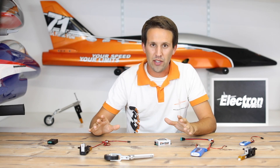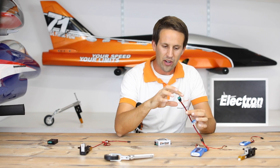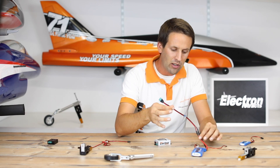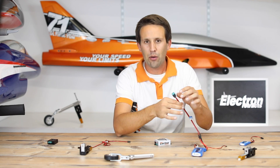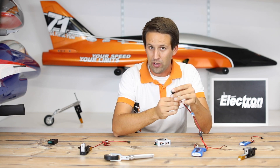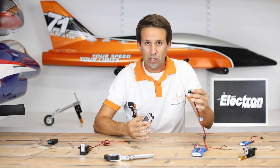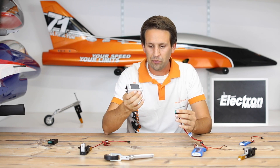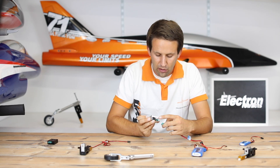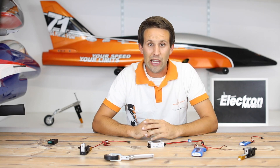Number two is even more obvious than number one, but it's still overly easy to make the mistake. Check the polarity of your batteries. If you buy a wire with a connector on it and simply solder them together, it's very obvious that red goes with red and black goes with black. However, if you're soldering just the connector, it's all too easy to solder the wires in the wrong way around. We've all done it at some point and the results can be catastrophic. Just make sure that before connecting it anywhere for the first time, the polarity as indicated on the controller itself matches with the battery. Otherwise, the damage to the controller will be irreversible.